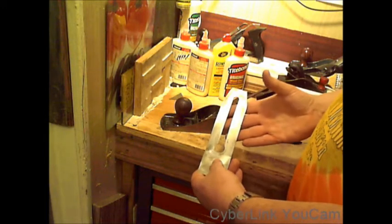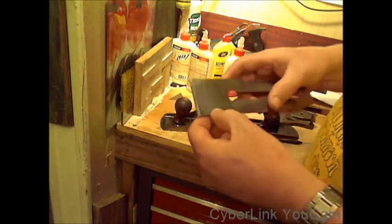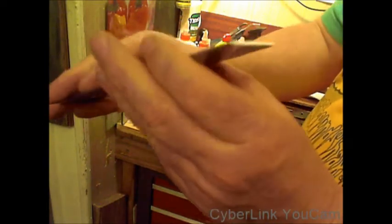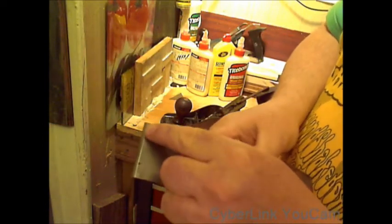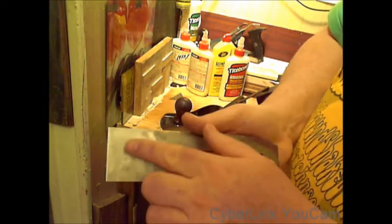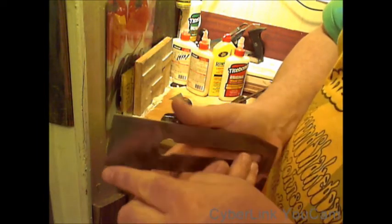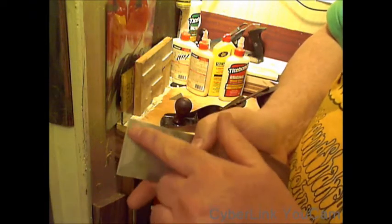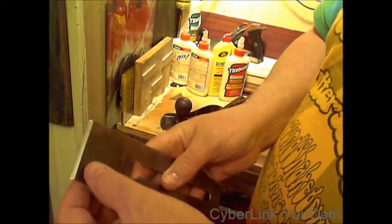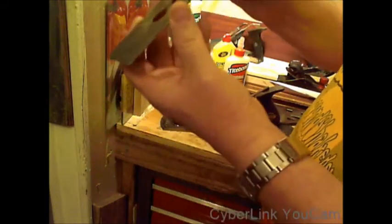This is a bevel-down plane. What we mean by that is: that's your bevel — this is at about 25 degrees — and unlike, say, a knife, this works like a chisel. There's only one bevel, there's no bevel on the other side. What you would do is flatten this side, and then you hone a bevel into this. Because you flatten this side and hone this — you effectively hone both sides, but you're just bringing this to flat and then honing this — you come to a sharp edge. These are called bevel-down planes because when you put the tool in the plane, the bevel is down.